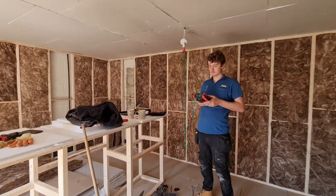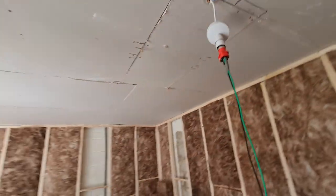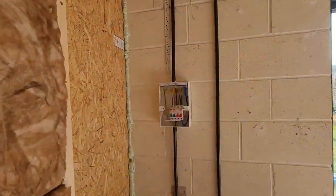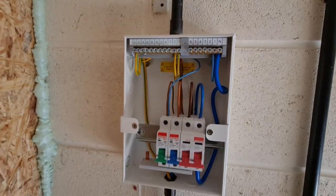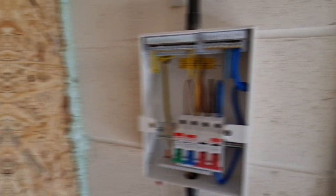We get a value of 0.61 ohms — that's our continuity of R1+R2 on the lighting circuit. We'll now repeat that with the line and neutral as well, just so we know we've got the right polarity down there. I've dropped in the neutral with the line and we repeat the test at the fitting — some call this a missing test on initial verification; you should do it. The result tallies up with what we'd expect, because we've got a larger conductor on the neutral than the CPC.